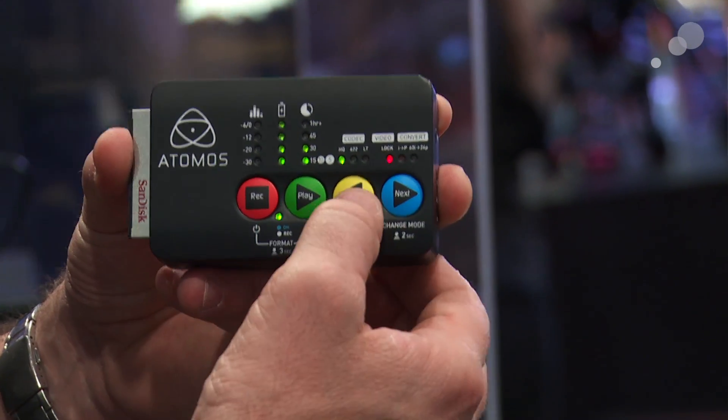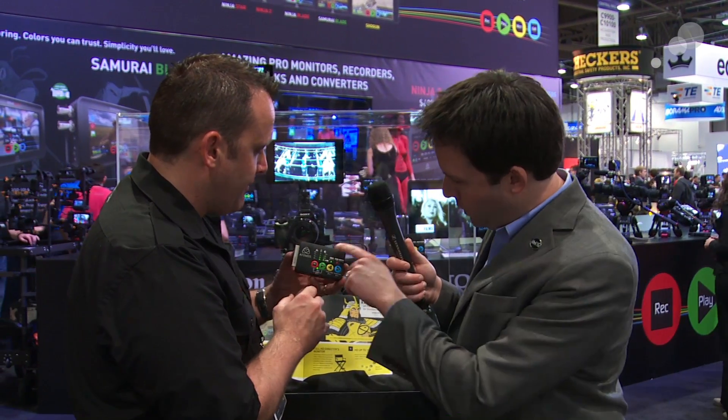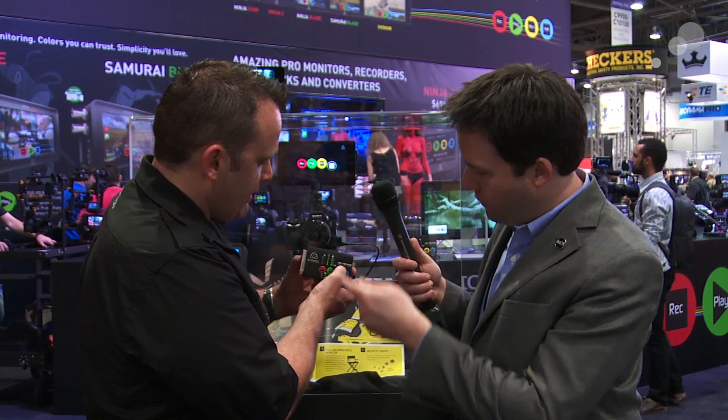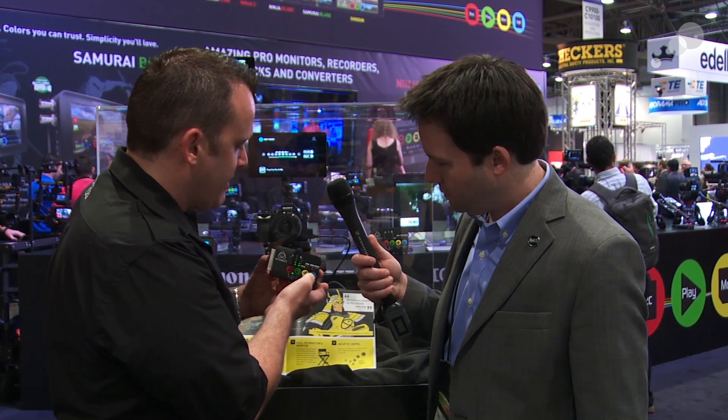So tell me about the interface. You've got HDMI in and out, and then you've got record, play, previous and next. So I've got a battery here — we've got it on the GoPro recording over there. You just turn it on. It's got an indicator for audio level meters, a battery indicator. It's loading the disc, just telling you by flashing. And that's runtime left on the media. This is the codec — you just hold that down for a couple of seconds and it'll flick through: ProRes HQ, 422, LT. You go through each flavor and it adjusts the amount of time required. This lock tells you when you've got a signal coming in. And then you can hold this down for a couple of seconds, which will give you 50 to 25 or 60 to 24 — so you've got 3-2 pull down in there as well. And to format the disc, you just hold the play and record button down.